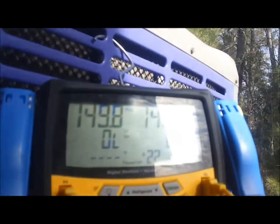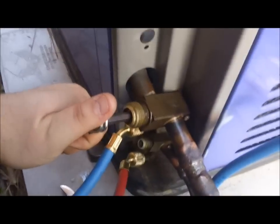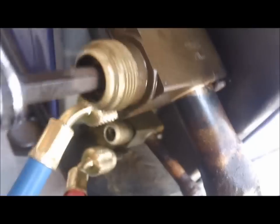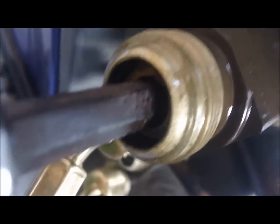I've got 149.8 pounds of nitrogen in and I think it's gonna be this suction valve the whole time. The guy that installed this probably didn't use a heat sink when he soldered it in. See - if I play with it, it's not leaking, but when I move it you can hear it leaking. Now it stopped. None of these solder joints are leaking - I'm thinking that valve is where the whole problem is.